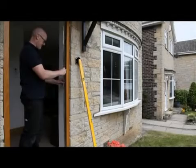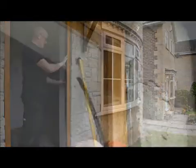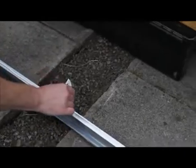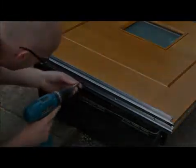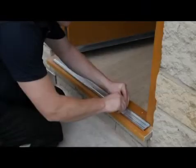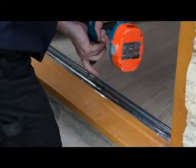After the door frame has been fixed into position, reattach the one-piece metal keep and weather seal into the door frame rebate. Using the silicone and screws provided, attach the aluminium weather bar to the bottom of the door. Hang the door onto the frame by aligning the security lift-off hinges and carefully lowering the door into position. Fit the aluminium threshold to the door frame sill, again sealing with the silicone provided.